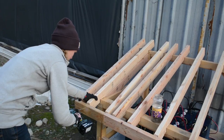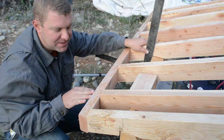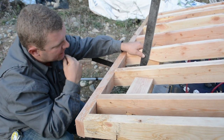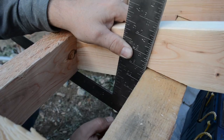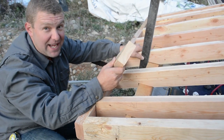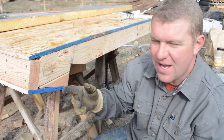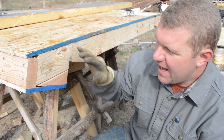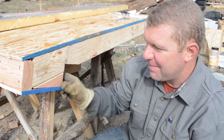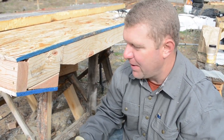Because we want to put a soffit on this frame, we went ahead and attached our fascia board, recessing it down ever so slightly to allow the roof sheeting to pass by. Now we're setting up the soffit hangers inside, using the timber frame square to create a box inside the soffit to get the measurement for the soffit hanger. The boxed eave came together nicely — it took a little time to figure out the soffit hanger, but the roof panel went on nice and flush with the fascia board. Alissa got those pieces cut and it's going to sit nice and flush against the post, creating a nice tight seal on the outside.